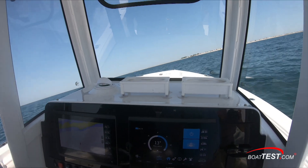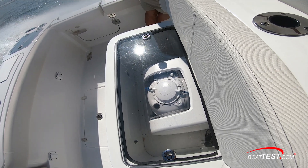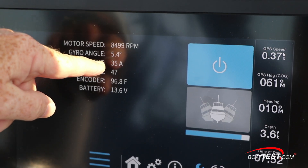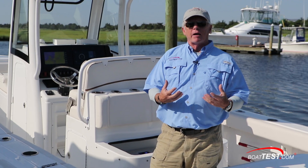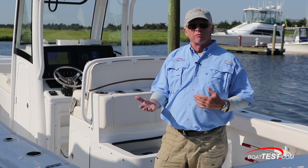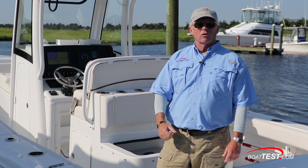It takes about 15 minutes to spool up to 80% power, and 100% power is reached at 28 minutes. Once it spools up to 9,750 RPM, the current draw drops down. Why? Because the gyro is in a helium vacuum, so it's a frictionless environment inside. That gives us the speed and the low amp draw.